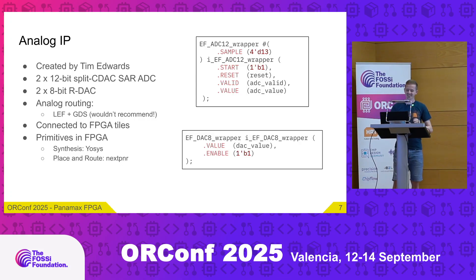For the integration, the approach I took — maybe not the best way — was to do a first run, place all the macros, take the GDS, then manually route all the analog connections, extract that, generate the abstract LEF, and then run the whole flow again. I can't have the analog connections in the Verilog, otherwise OpenROAD would try to route them with the digital router. So I have to add these analog connections afterwards to the final gate-level netlist to get LVS to match. I'd like to ask the community if there's a better method — perhaps using the Python API in OpenROAD to set a different wire width.